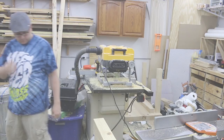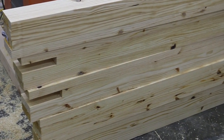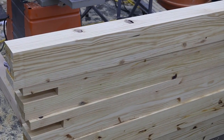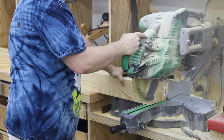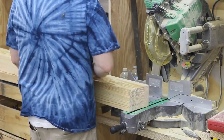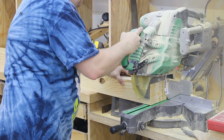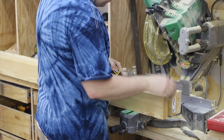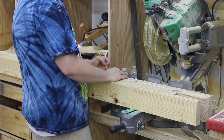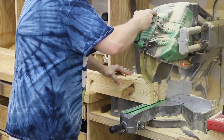The edges are just getting skip-planed to make for a better glue-up. When I cut out the pieces for the tabletop I left notches in some sub-assemblies — that's where the tenon of the leg will fit into the tabletop. Here's all the stock for the tabletop, planed and jointed and ready to be glued up. Before the glue-up I'm squaring off the ends of each sub-assembly, doing a little math to make sure I'm only taking off the right amount from each end to hit my final length.